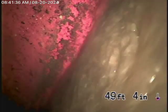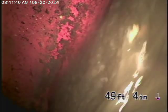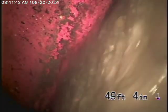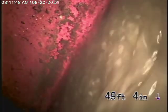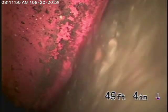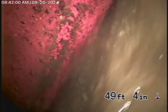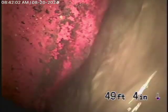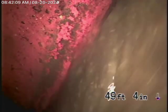We're here at 3213 Park Vista Drive in Glendale to check the main sewer line only from the 4-inch clean-out located here where the pipe exits the house. In the front there's a 4-inch clean-out, and when we ran our camera in there were roots right by the connection where the ABS clean-out connects to an ABS pipe, which then goes down the hill — all ABS plastic — and goes into the street with a 6-inch clay pipe.